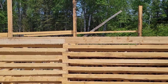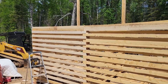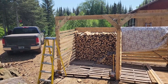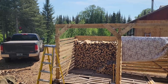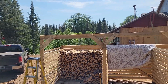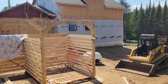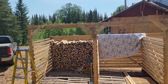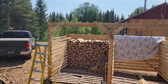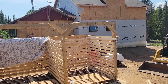I'm going to start working on the other side over there, but the wind's picked up a little bit so I don't want to have my camera or phone on me. So I apologize for not getting a chance to record this, but the back wall is done. The top front is done and cross-braced. As you can see, next will be milling some 3x3 posts that are going to go from the front to the back — that'll be the next piece of the puzzle. Then we'll put stringers on top of that.